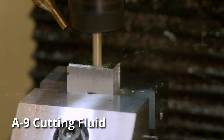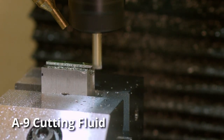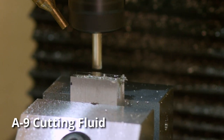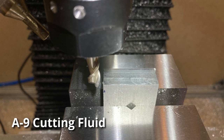The next thing I tried was A9 cutting fluid, which is marketed specifically as an aluminum cutting fluid. It's fairly sticky. On the climb pass you can see chips going directly to the right, which is a good sign that things are cutting well. Once I wipe it off and look at the photograph, you can see it looks pretty similar to the mineral oil. And I learned afterwards that A9 cutting fluid is predominantly mineral oil — it contains some additives that do various things, one of which is to prevent it from misting, so potentially it's healthier. Certainly it's more expensive than mineral oil. There are two odd things: the bottom half of the part has more cutting marks than the top, and on the top where there aren't those stacked coin marks, there's an odd texture — probably leftover residue from not cleaning the part well before taking the photo.